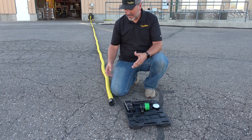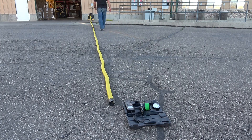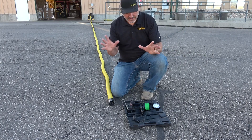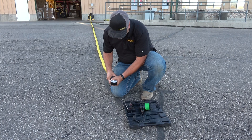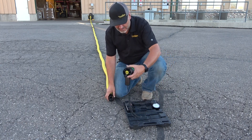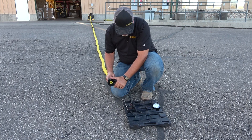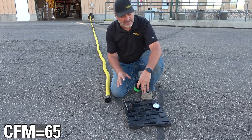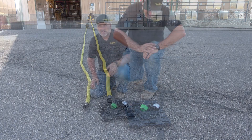We are now out at 50 feet. Let's do some testing and see what our readings are. Let's do the pressure test — it looks like we're reading about 84 inches of water lift; we lost a little bit but not much. And the CFM reading looks like about 65-66 CFM on that. Let's add another 25-foot section.